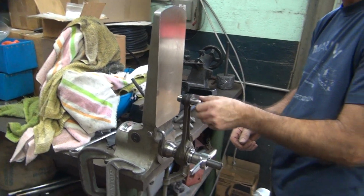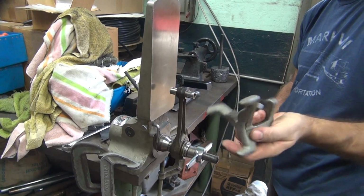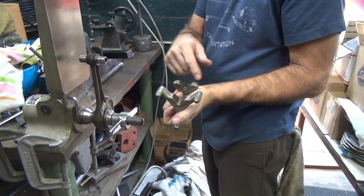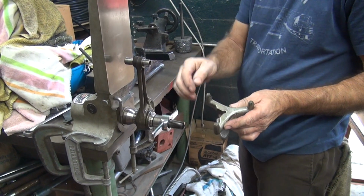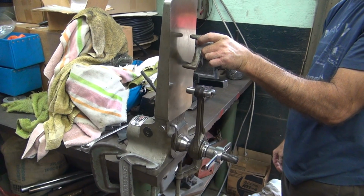This is a wrist pin. It goes in a hole. It's relatively tight. This is a dog. A dog? Like a roof dog? Yeah, roof dog. So it has a V angle here, so it's centered on a round surface. And this is perpendicular to three surfaces here. So ideally, when you put it in here, there's no gap. Now, if it's like that, you got a problem.